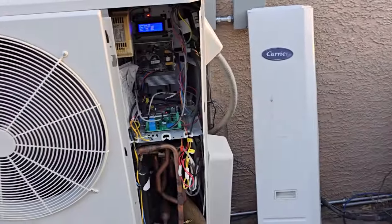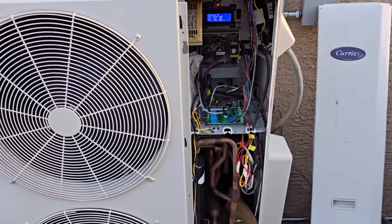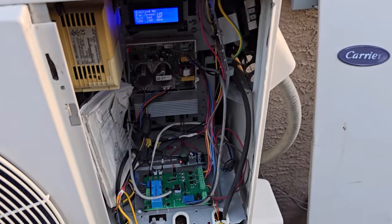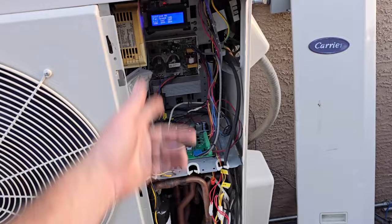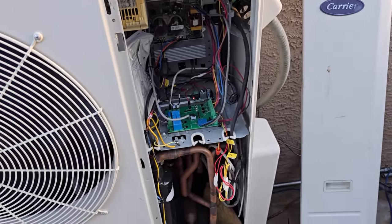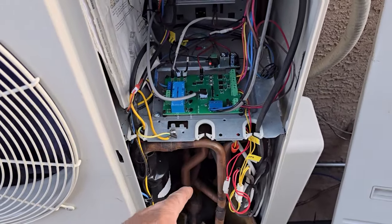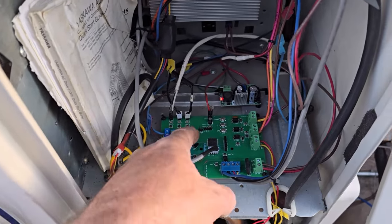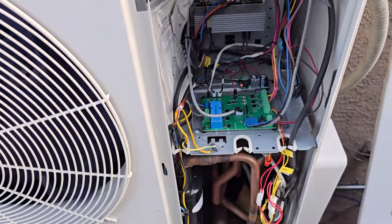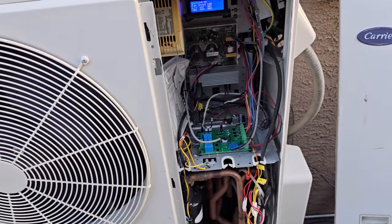But I just hate to do that one too. If there's an issue with my controller or something I designed, it would affect possibly both units at the same time. And really, if anything was weird with my controls, I could throw in a couple relays in here just like I did in the Lennox — because the Lennox didn't have a controller I made. I just used two relays: one relay to bring the compressor on at 40 Hz and then the next relay would speed it up to 60 for Y2. And then the reverse valve was just directly powered by the thermostat. I did change the other one to a low voltage coil, so I might get another low voltage coil and put it on here. Seemed like it was less glitchy running the low voltage one rather than switching that 230-volt one through this relay. It used transistors, not optical isolators, so sometimes you get a little bit that just picks back up through the processor. I thought it was going to be fine, but it might cause intermittent glitches — even though once the reverse valve is engaged for the summer it's engaged the whole time, so it's not going to be switching.